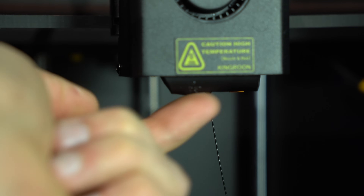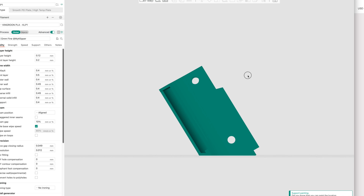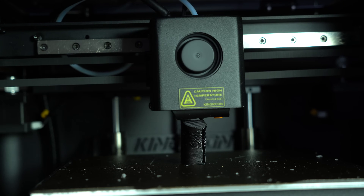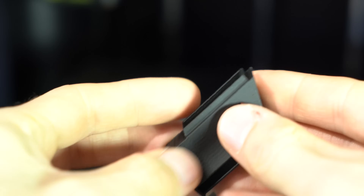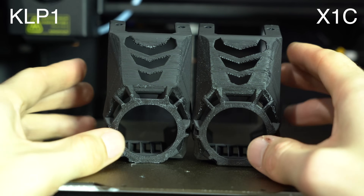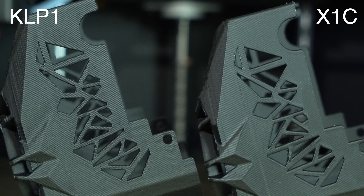After my PETG printing, I noticed that the fan shroud had warped from the higher bed temperature. I'll never understand why printer manufacturers ship ABS-capable printers with PLA fan shrouds. Fortunately, the fan shroud STL was available online, which was the perfect excuse to test the KLP1's ABS printing capabilities. I did the basic configuration of temperatures and set the fan speed to 0, but the result was poor, showing evidence of overheating. For the second attempt, I decreased the print speed and increased the fan speed — the result was much better. I then tried the Devil Burner print head cover for the Creality K1, which I had previously printed on my Bambu Lab X1 Carbon. Overall the results looked great. The surface over supports looked better on the KLP1, however there were more surface artifacts on the sidewalls, with overall print quality looking better on the X1C.